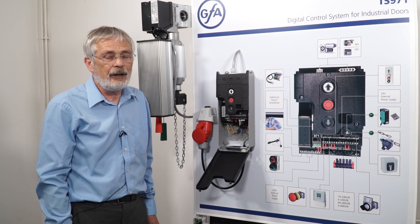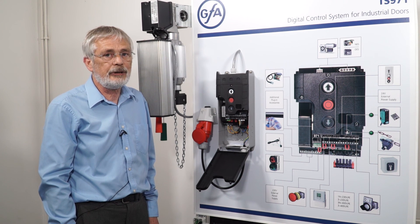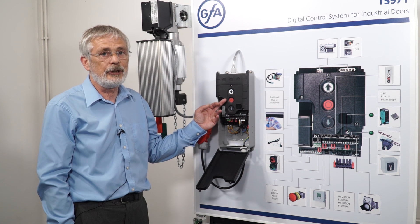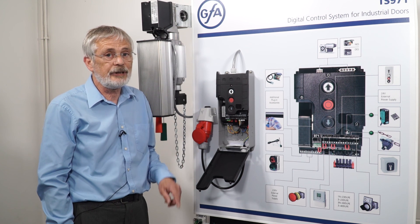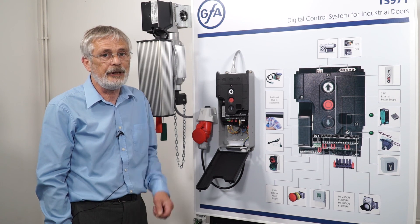The final thing can be interference. If you have two doors next to each other, they should be put on separate channels. So if this door is on channel 9, the next door should be put on channel 11 — not 10 — and the next one on 13. Leave a gap between each one.